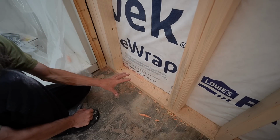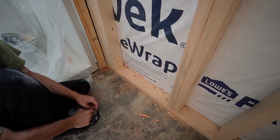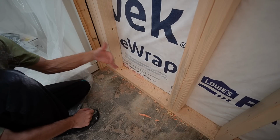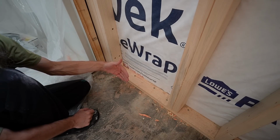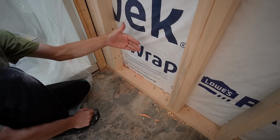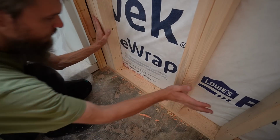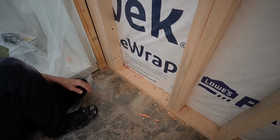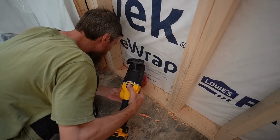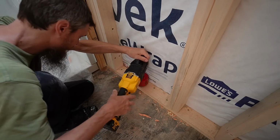If you have to put your toilet on an outside wall, consider framing out another wall to contain all the plumbing and protect the toilet carrier from freezing, from siding nails. You don't want anything puncturing it. So that's what we did. We're putting it in our fake wall. And there is insulation behind here.